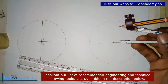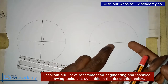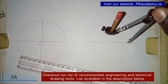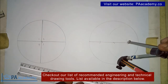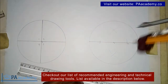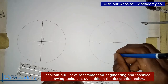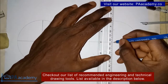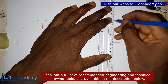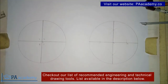You bring back your compass and increase it to any convenient length — just make sure it is longer than the distance between point 1 and point 2. Now place the compass on point 2 and draw an arc at the top and another arc at the bottom. Then place it on point 1 and draw an arc at the top and another arc at the bottom with the same length. You are going to note the points of intersection where these arcs cross each other. Bring in your ruler, join the intersection points together — it will pass through the center and touch the circumference of the circle.